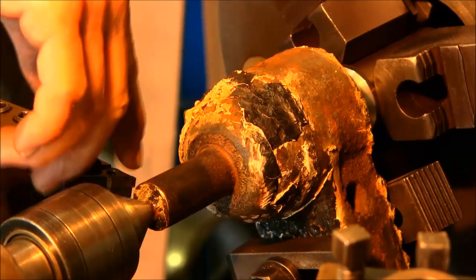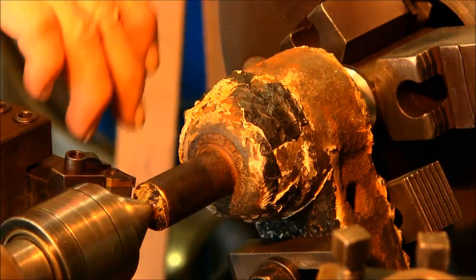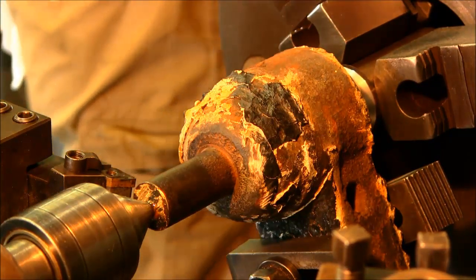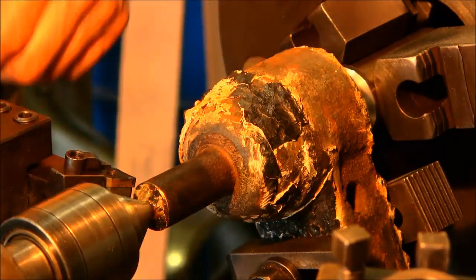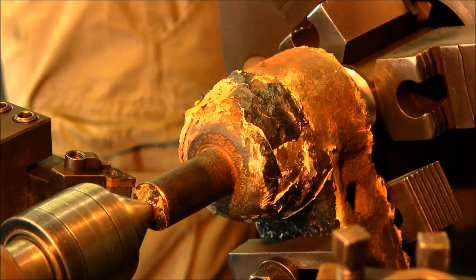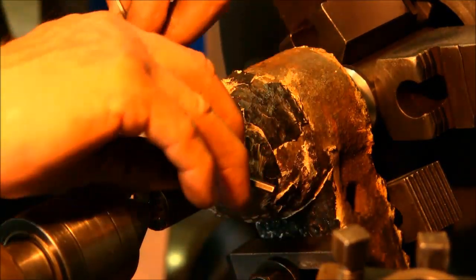Alright, now I'm going to go ahead. This is a negative acting, it is a negative insert, but I want to go ahead and change this out to where I have a scoop or a positive top on here, which I like. It just seems to act more along the positive line there. I'm not going to argue the terminology on it. I just know it's an easier cutting.